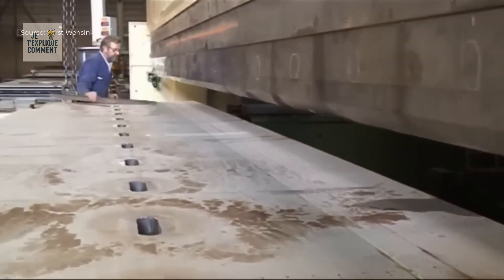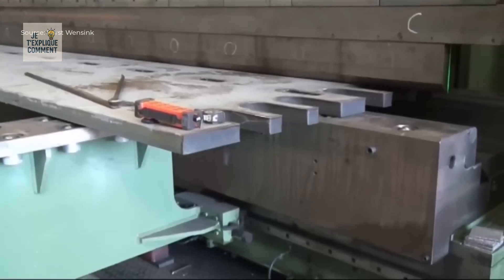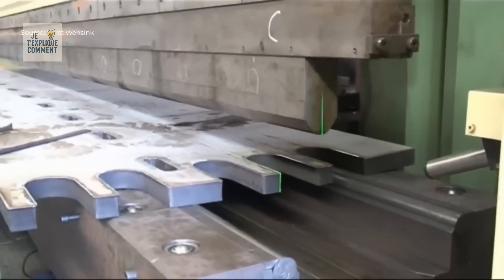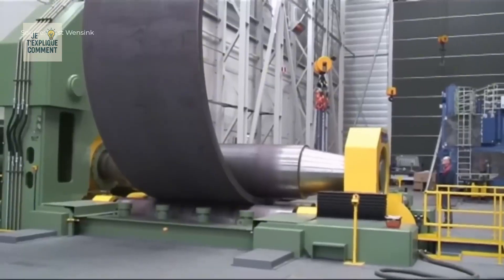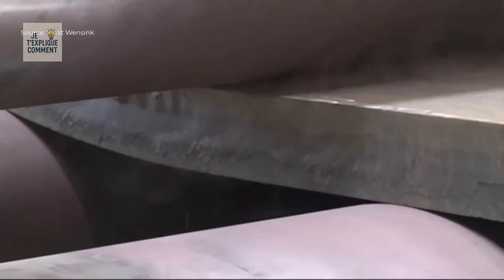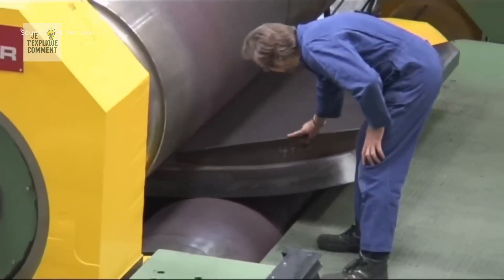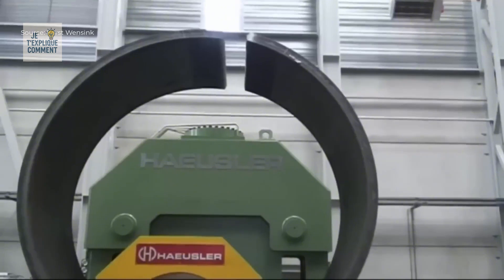And sometimes it's necessary to go even further: a 43-ton steel plate, 150 mm thick and 2,230 mm wide, can be bent into a 5,000 mm diameter cylinder — an operation that illustrates the extreme capacity of this extraordinary equipment. Every phase, from edge preparation, preheating, cutting, rolling, and welding to pressing, is carried out with absolute coordination and rigor that guarantees the reliability of the final pieces.